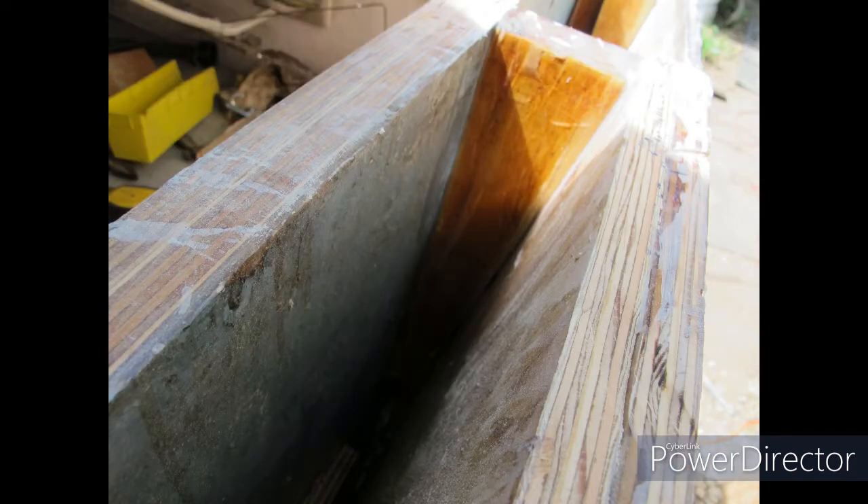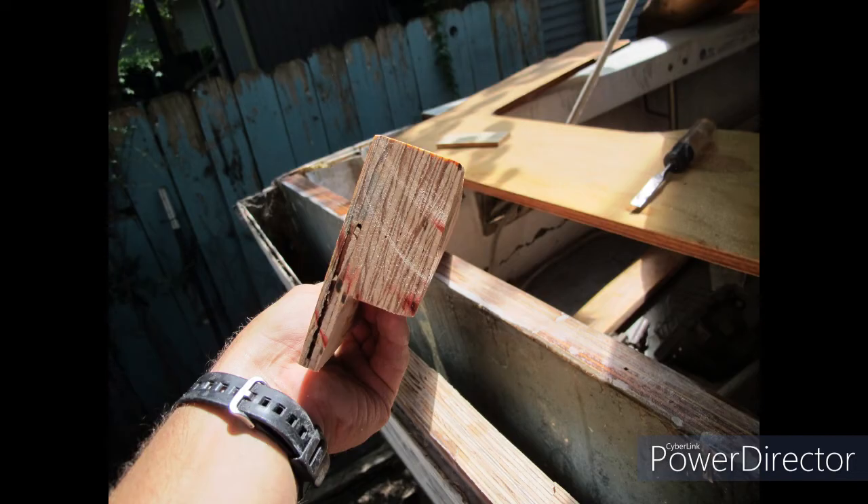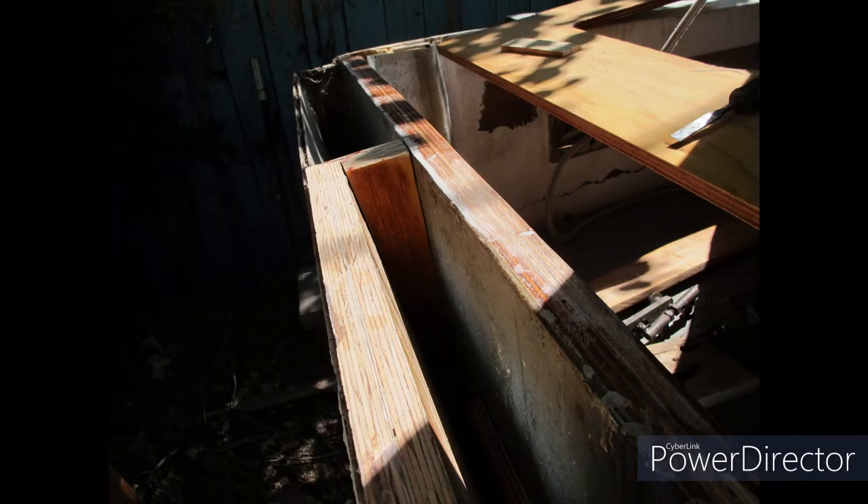And if you remember, there's that angled cavity between the transom on the back of the boat. I cut all new pieces on that out of laminated veneer lumber — LVL — that I had from doing some work around my house. Here you can see it's dadoed in, and that's all received numerous coats of epoxy and fiberglass on it.